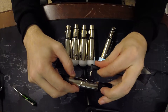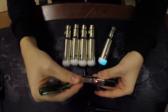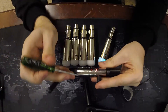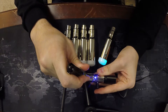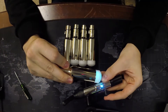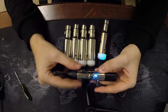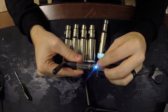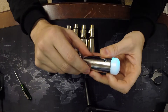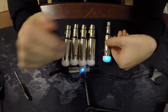I have the power cord hooked up and I'll plug the transmitter in. It lit up red. Since I first had the receiver on the red channel, I'll change the transmitter to match the receiver's current channel by hitting the button to cycle through — blue, purple, light blue. Now both the transmitter and receiver are on the same channel. Once I apply DMX to this, the transmitter will start blinking red meaning it is transmitting DMX, and the receiver will blink green meaning it is receiving DMX. All receivers work simultaneously — one transmitter to five receivers, all receiving the same DMX universe.